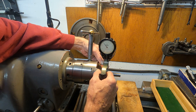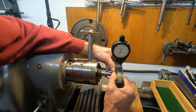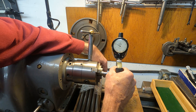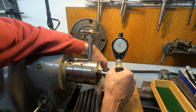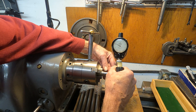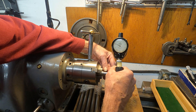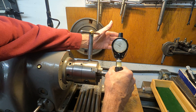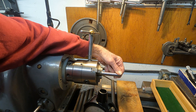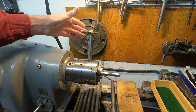Now that's not a problem with this, and I'll explain that as we go on. Let's get to the end and see where we're at. We are seven ten-thousandths even smaller on the end here, and the minimum clearance again is six ten-thousandths to one thousandths. So this is a terrible, unacceptable bearing surface for that fit.